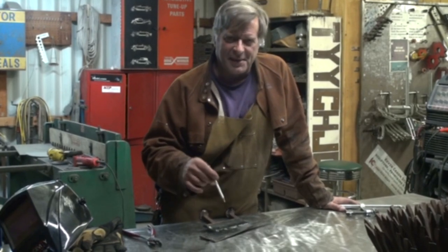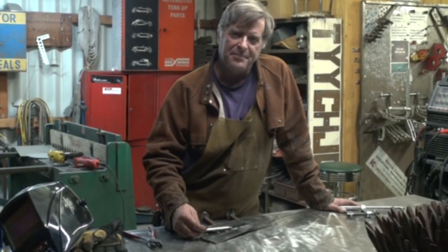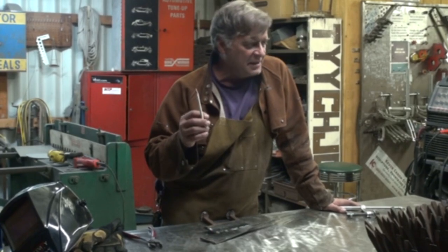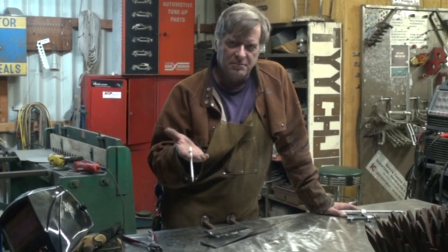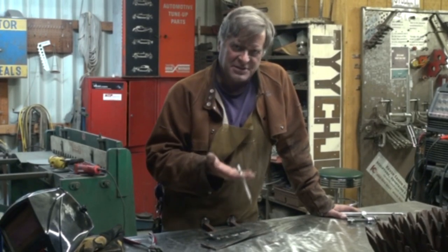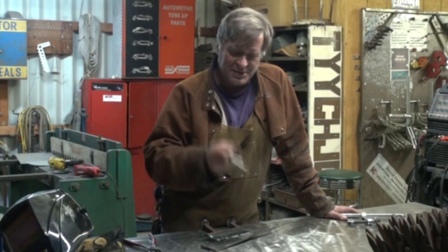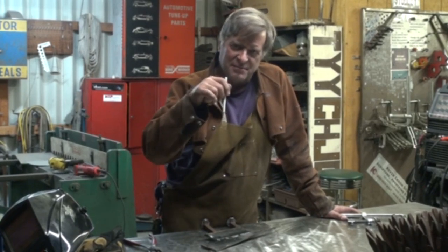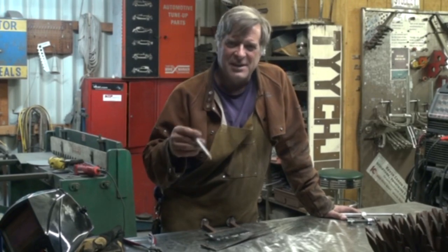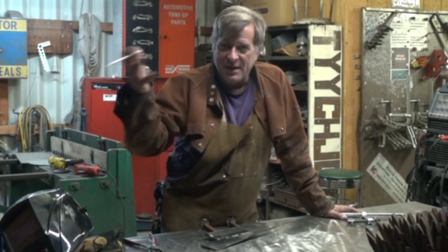A couple of other backyard tricks I've done: I've actually taken a coat hanger, straightened it out, and laid it down inside the gap just to help bridge it a little bit. You can even get a piece of copper — if you're welding steel, get a piece of copper, eighth-inch or quarter-inch preferred — and use that copper as a backer on the back side of your gap, because the steel won't stick to the copper. Clamp it in there however you have to do it, and that gives you something to hold your molten puddle up with as you're filling that big gap. You could even take another piece of steel and put it on the back and weld it in, as long as it's not going to get in your way.